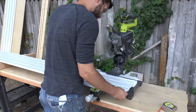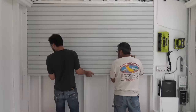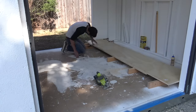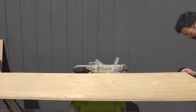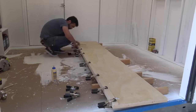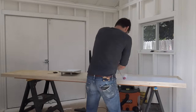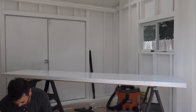Now for shelving and storage — I checked out a lot of the different modular storage solutions before picking the Gladiator system. It's super strong and frankly I thought it looked the best. There are all sorts of hooks, bins, and shelves that can plug into it, and I like that it's heavy duty enough to even store my miter saw. I wanted a work surface that would run the full width of the workshop, so I glued and screwed two layers of three-quarter inch thick plywood together. I ripped some two and a half inch wide strips of plywood to glue and screw to the front edge of the counter so that it would have a nice thick front face. I sanded away all the excess glue with my belt sander. I finished the worktop with four coats of Rust-Oleum oil-based high-gloss paint, using the smoothest finishing roller I could find at Home Depot — the results came out really nice and smooth.